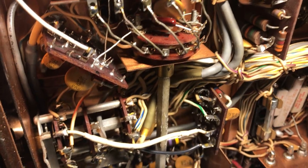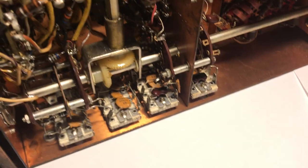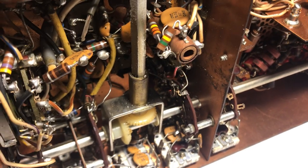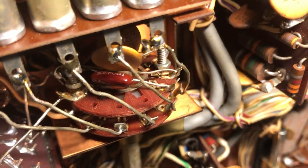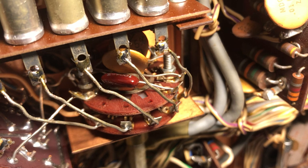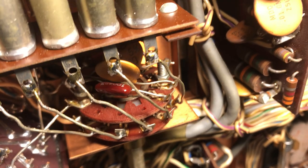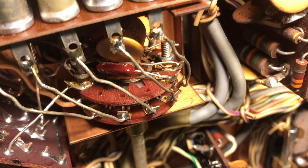All this stuff has to work if you want to get a signal out of it. What's funny about this TX4B is the way the band change works — it has a 90-degree gear in here which is really aggravating and there's some flop and play in this thing. When I was looking at how this wafer switch moved for the crystals it just seemed really sloppy. We're talking like 1965 or '70 here — old radio.